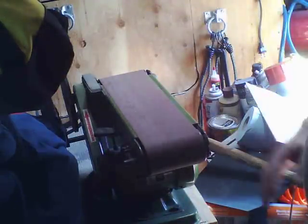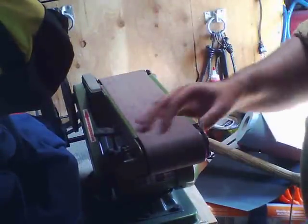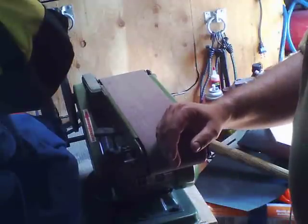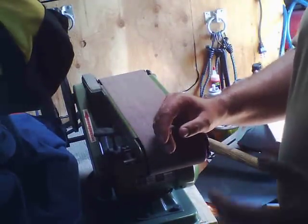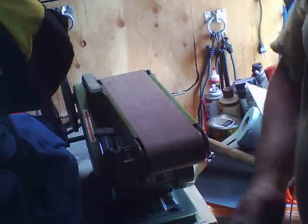And before we get into any sharpening stones, you got to realize the sharpening stones in our society are small. If you look at museums, you look at ancient society, people that had to sharpen big tools and axes and swords and stuff like that, and they didn't have power tools for it. They had sharpening stones that were big. Okay, and the reason is you can treat a lot of surface area on that edge in a short period of time with a big stone.